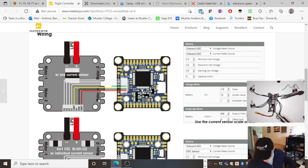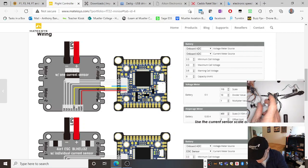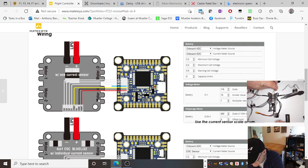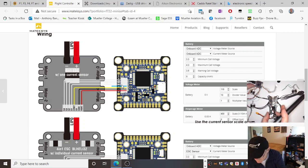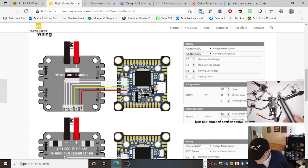It'll be on the flight controller where it plugs in, just there. All right, and that's this part here. It'll be printed on the board what all the bits and pieces are. It's got your numbers 1, 2, 3, 4, and it's got some other bits. It's got power, it's got some earth, and it's got some other lines. But remember, your flight controller is commanding. Power's coming in through here on your power distribution board.